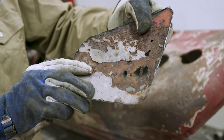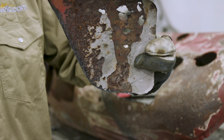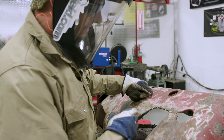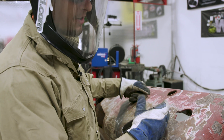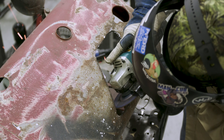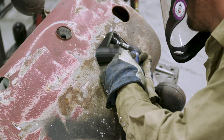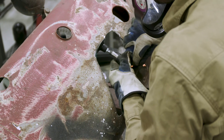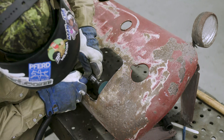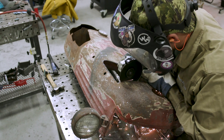That's pretty nasty — looks like someone tried to fix it before with some Bondo. Now I'm gonna clean up these edges here. I'm gonna grind them off with a little grinder with a hard rock, just shape it off right here, make them a little better. So we're gonna clean the burr off the cut we made and clean up the metal on top about a half inch back so we can weld, then we're gonna flip it over and do the same thing inside.